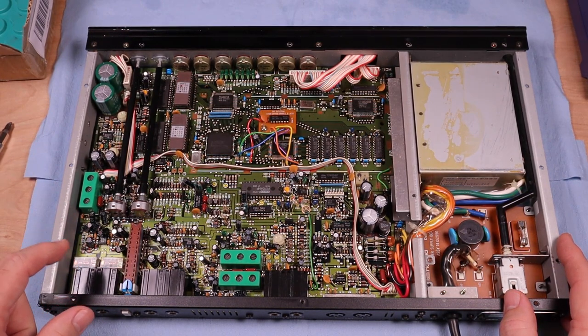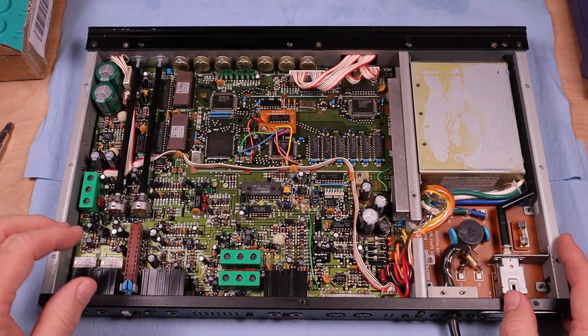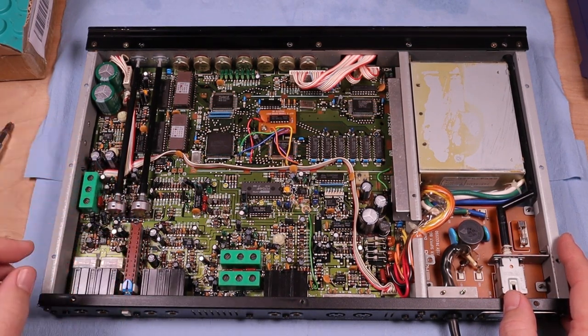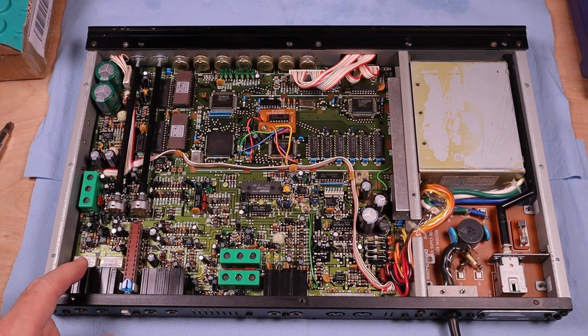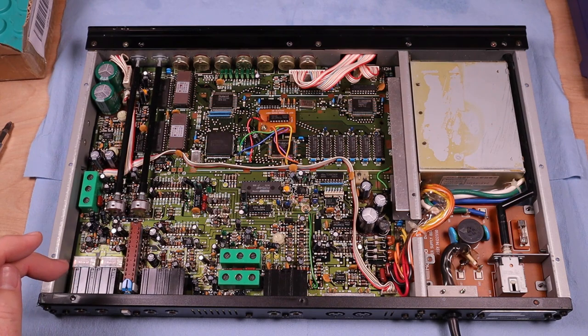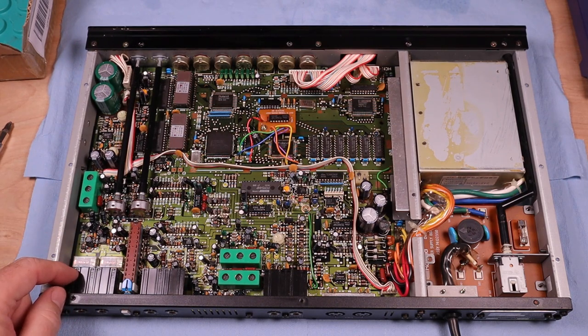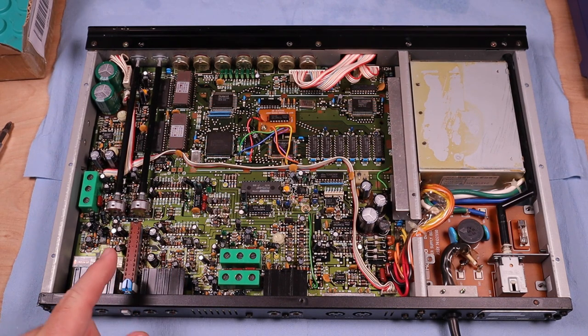The real big problem with it is these jacks — they're loose. You have a cable stuck in here and it hangs, and your audio level jumps up and down. That's not very good news because I personally have been unable to find these input/output jacks for these units. Roland doesn't sell them anymore. These are a dual-ganged unit on each side, but they have a particular switching system. When you insert a quarter-inch plug, one of them takes it out of bypass, and if you insert a plug in the other side, it will put it into stereo mode.